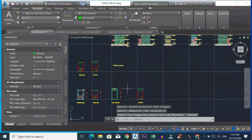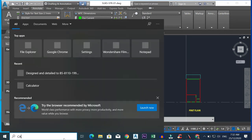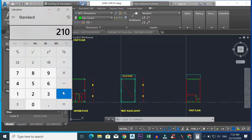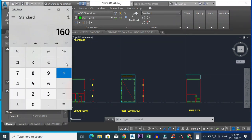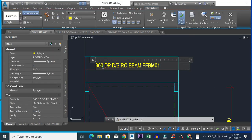Yeah, it's 210. So what we're going to do is establish a 50mm step. So 210 minus 50, let's calculate that. 210 subtract 50 gives you 160. Right. So instead of 210, what if we say we're going to use a 230 thick slab minus 50? What does that give you? 230 subtract 50 gives you 180. So we're going to have a 180 thick, or we can use a 220. I'm just going to see which we're going to use for the slab thickness.